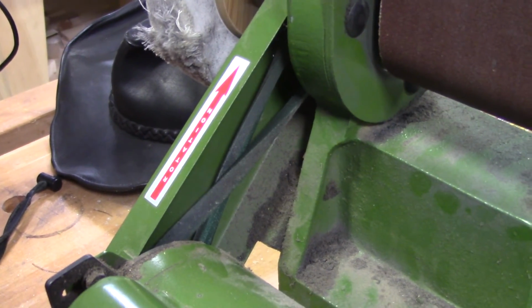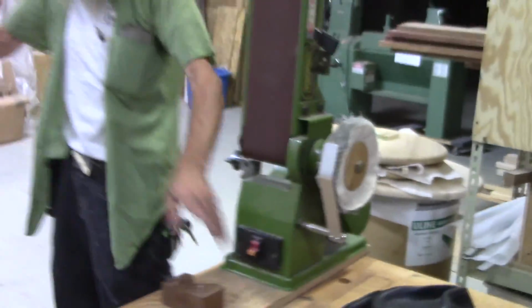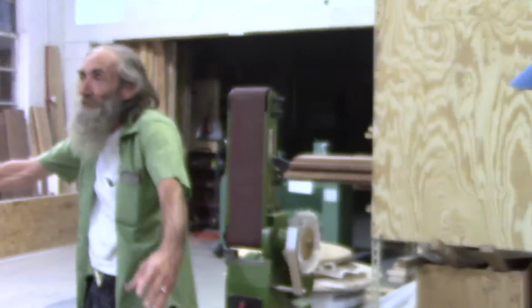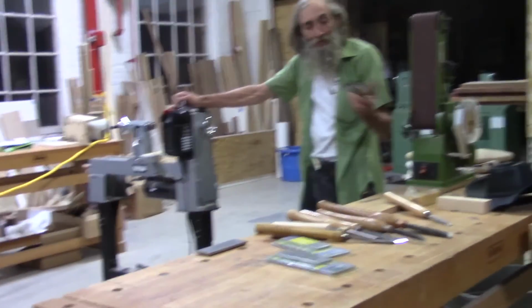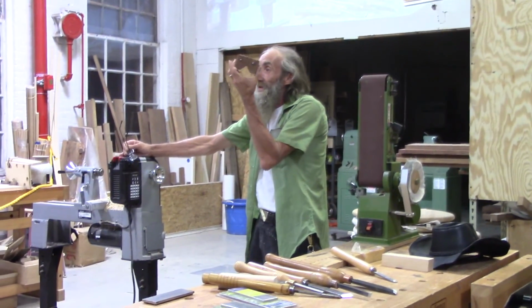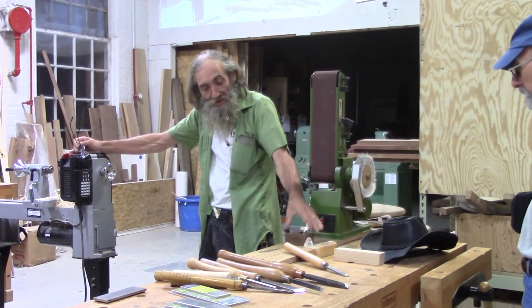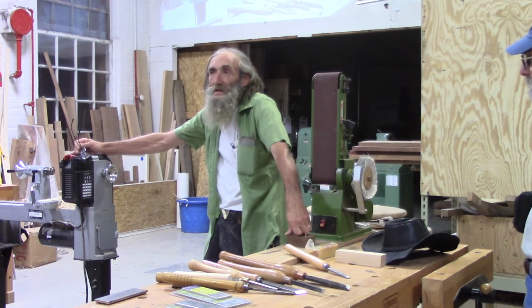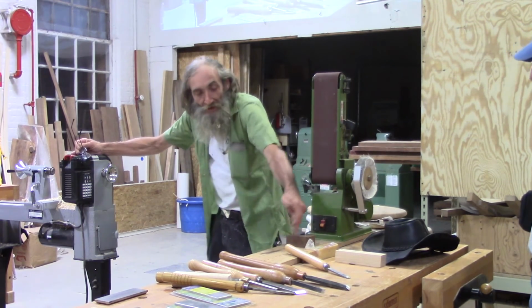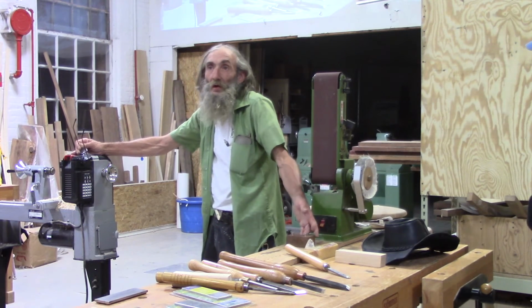And the plate underneath, if I was going to do the plate over again, for anybody who's thinking about doing this, I would probably put a piece of T-track on there and make it fully adjustable instead of my series of 1/2-inch holes. Because even with the 1/2-inch holes and the 2 sets of pins that I have on my V-block, I can set this in 1/4-inch increments all the way down that board. But I think if I did it again, I'd just put a piece of T-track down the middle here, and make a carriage that slid over it with a V-block on it.